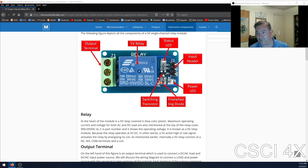I mean, it does matter. Obviously, you don't want the motorboat racing off without you. But you know what I mean. You have a GPIO pin that you can control, and when that GPIO pin goes high, the relay reads a high voltage here, and the relay is kind of an electromagnet. So when it gets a little bit of signal here, the electromagnet slams over and it conducts a lot of electricity.